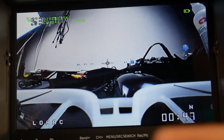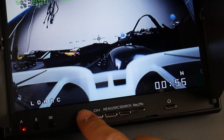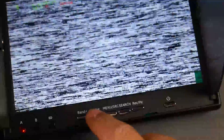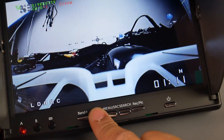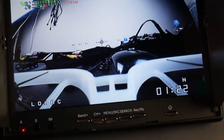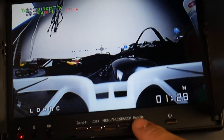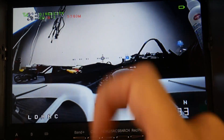As you can tell, we have diversity mode and it gives you the channel and band. You have separate dedicated buttons for channel and band, which is really nice — it's a lot faster to change. I can just switch the channel really quickly. And if I wanted to switch the band, I don't have to hold the channel button for two seconds — I can just immediately switch the band. That's really useful for a quick channel change. We also have a DVR which is really cool. If you press it once it'll take a picture; if you hold it for a second and let go, you get a recording indicator showing it's recording.